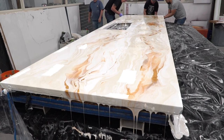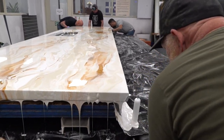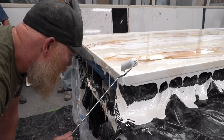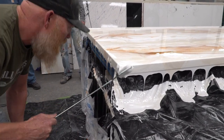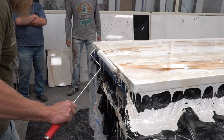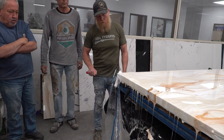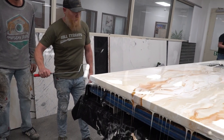The only thing I'll do is roll any little areas — I'm not going to roll it to try to get color or texture anywhere. I just like here where there's surface tension — I want a little epoxy on there and I want to make sure to break that surface tension. Now that should flow. Put a little excess up there to pile right over that corner. I know it looks kind of messy, but this is probably the best way to do that. Pop those air bubbles, make sure it's flowing. Just break that surface tension — if you see surface tension happening somewhere, make sure you allow it to pull off. We'll be cutting — this is basically the legs of the table because we are mitering this whole thing. The bottom doesn't matter — I just like to practice on all my edges, and that's why I sandwiched frog tape on those layers.